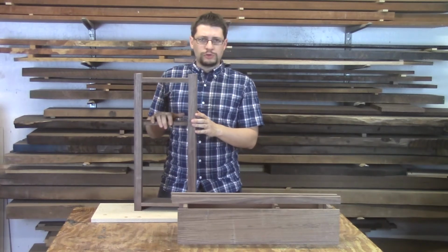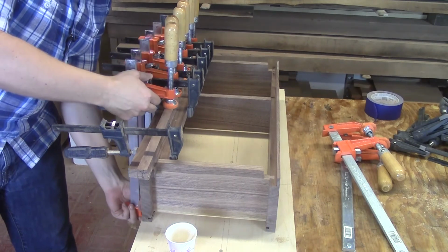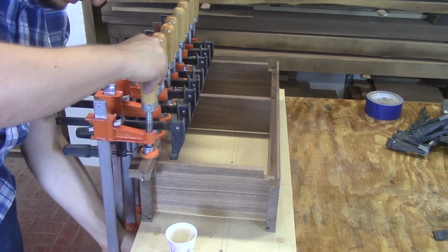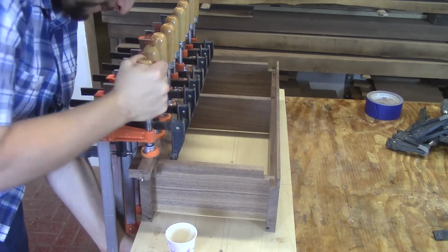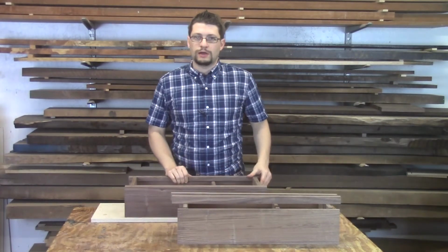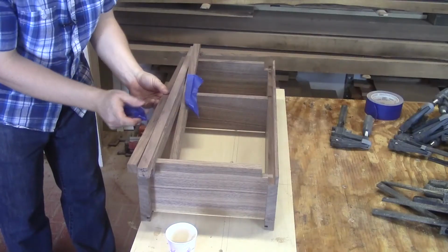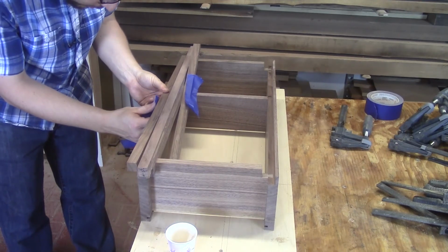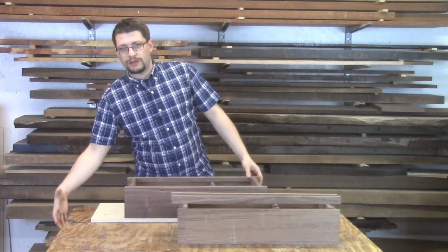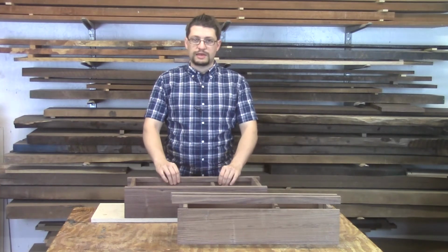The shelves are glued into those sliding dovetails, and there is just a ton of clamps, as you can see, that help glue in this rail into the rabbet. Now, I had another question online, or comment that was on Instagram, which was clamping cauls. It was hard to see in the picture I posted on Instagram, but yes, I did indeed have clamping cauls. Clamping cauls on top with the clamps all the way across the depth of the assembly table here. I had clamping cauls inside as well as outside the cabinet.